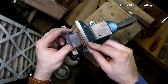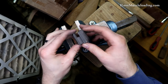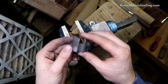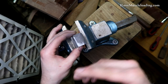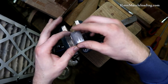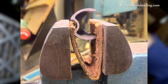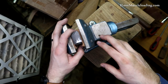I've got my nose cap here and we're going to clean this up. I picked it out really because it's small and I don't think it'll take too much to get it cleaned up. Our main areas are these two large curved faces here and this angled face. I want to try to work the longest face I can all the time when I'm cleaning up and filing like this. So I'm going to grip this in my vice like this, straight down, and I'll give you a side shot so you can see how we're holding it. That's how I've got it clamped in the vice.